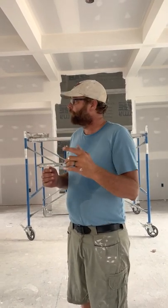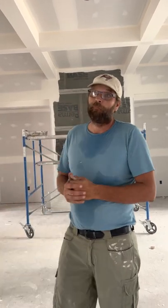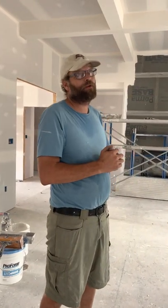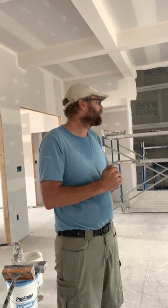In this house we have run the entire bed coat — block coat, some people call it. From there, what we'll do now is go back through and run the box. The only thing I have to tidy up now is the box — I have to rerun my three-ways one more time and run the beads. This house is about 500 sheets and we're going to get most of it skimmed out before one o'clock or so.